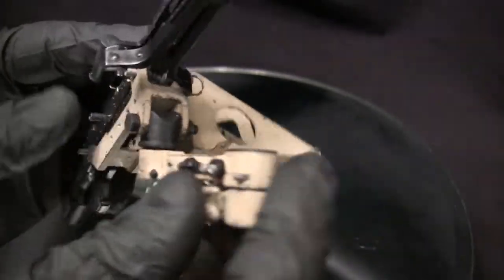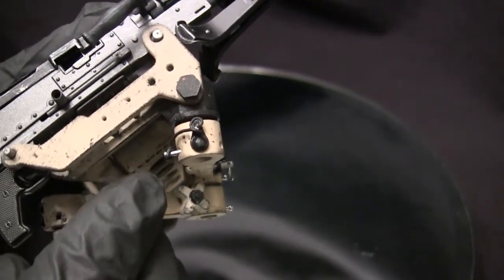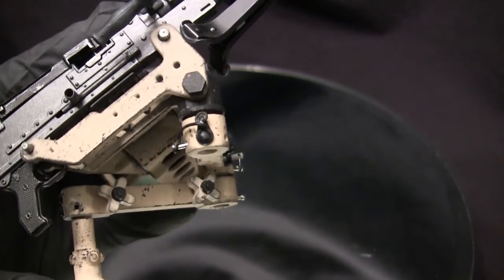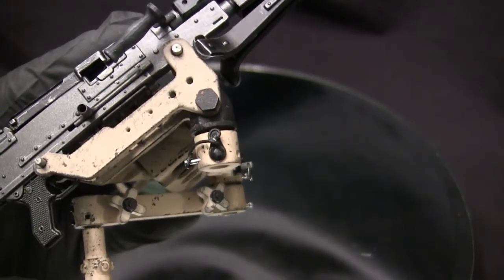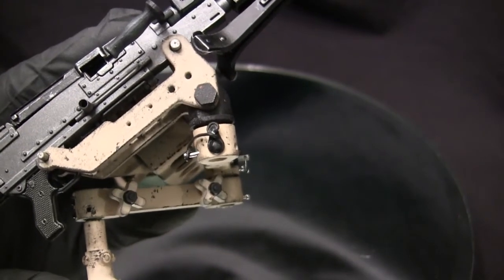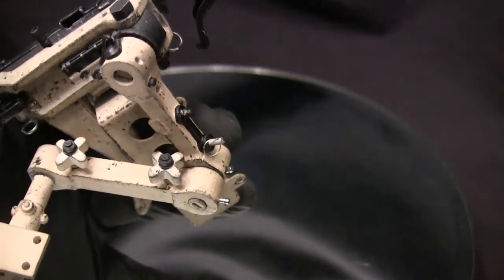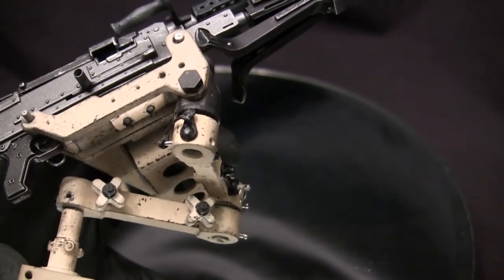Back to the cable I was touching upon before — you can see the cable right over here, which is used to keep the securing pin in place. This detailing is made out of a very thin and flexible piece of electrical wire, and a length of electrical wire is going to be supplied with the ECA sets. The builder needs to bend it to the shape you see here, and the material bends very easily. What's also nice about the wire is that since it's just covered in black silicone, the need to paint it is unnecessary, and it looks very realistic once fitted in place. The same is true for the retention pins found on the various locations on the model — these are fabricated out of bits of metal wire brads and are left in the white, again replicating the look I saw on the real unit.